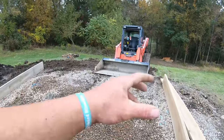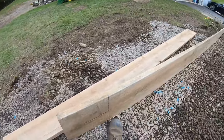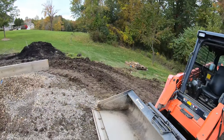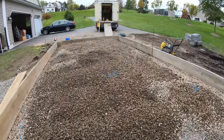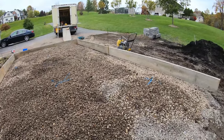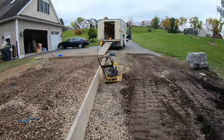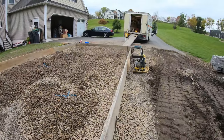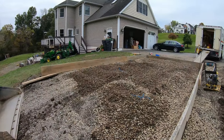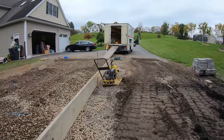But other than that, we need a bunch of stone back here because we gotta back these forms too. You know, you gotta remember the form. At this line, we're gonna put some stone here or dirt. He's got dirt here somewhere we could scrape up. But a few more tons of stone, just grab a full load, use what I need, and stockpile the rest at the yard. This morning I just got 10 ton, because like I said, it called for 7, but you know, things change in the field, obviously, with elevations. Thought the elevations were a little bit better than they were. This is the only board that concerns me, and I'll straighten that out in the AM.